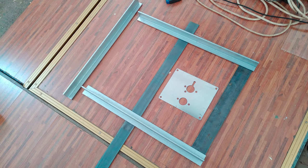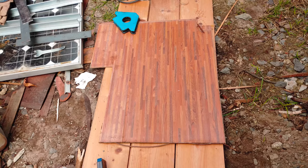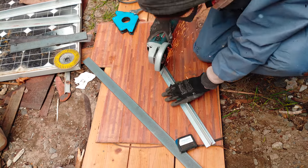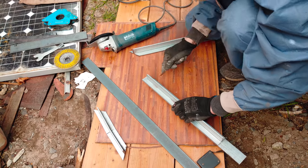Here's the solution I've come up with. I got these steel T-profiles and with these I'm going to build a square frame which is open on one side. I cut the ends of the three pieces into a 45-degree angle, so I can weld them together into a 90-degree angle.